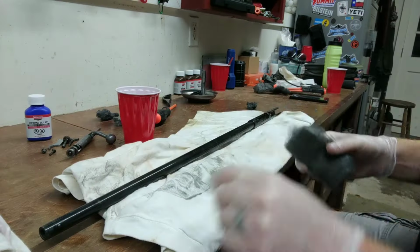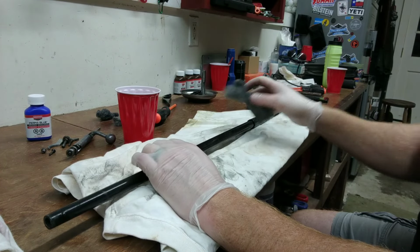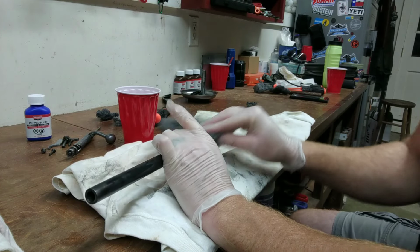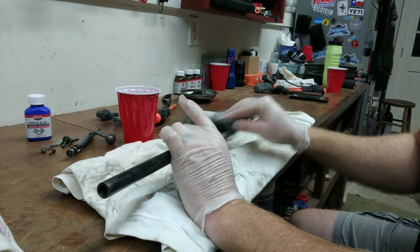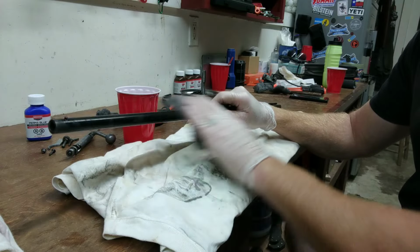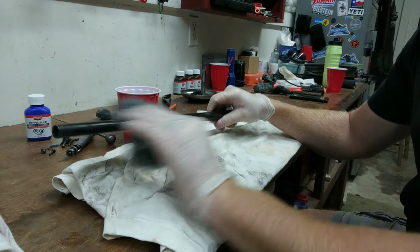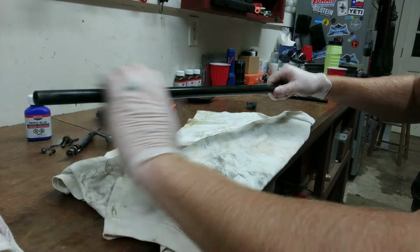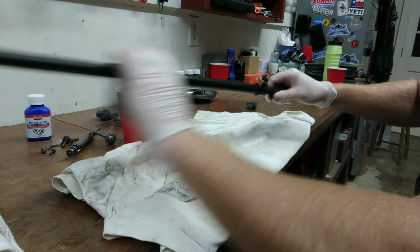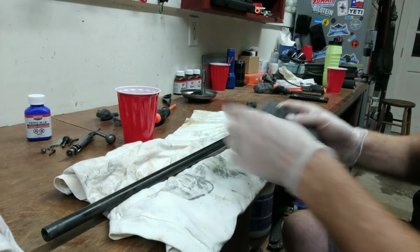Alright, I'm going to rinse this all the way back. Well, it's blotchy in spots, so I'm going to take our double-aught steel wool, lightly polish it to try and even it out a little bit. And that scrapes off some of the darker spots as well, but we'll go over it again anyway. Again, don't rub too hard here. We're trying to let this set in still, if I even use that vocabulary correctly.